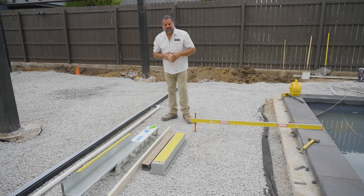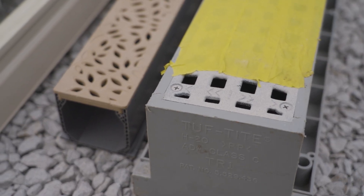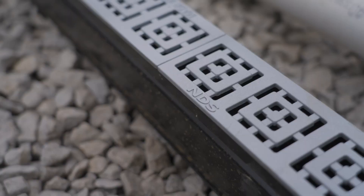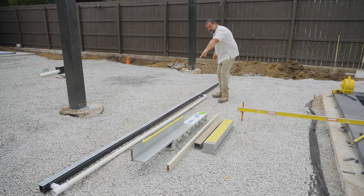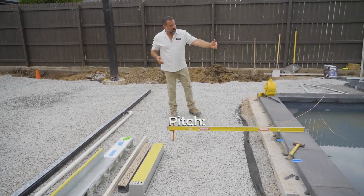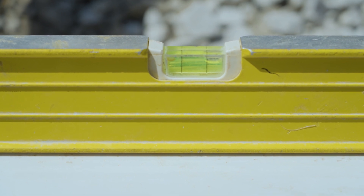It'll be installed about one-quarter inch lower than the chamfer on our paving slabs on either side. We also have one, three, and five inch options. The one-inch requires a lot of maintenance — not my favorite. The three-inch has a nice decorative cover. The five-inch unit has already been textured painted and protected for installation, with a very attractive slotted style top painted in gray nickel. You can see the PVC pipes for positive flow water out to a reservoir, dry well, or pop-up drain. The pitch from our coping to the drain will be one-quarter inch per foot — in a four-foot area, that gives us one inch of fall to the drain.